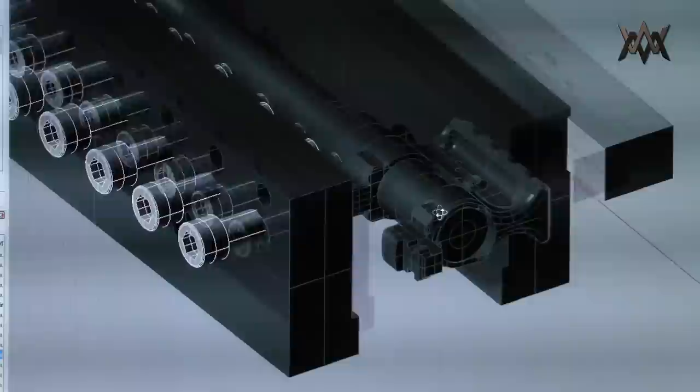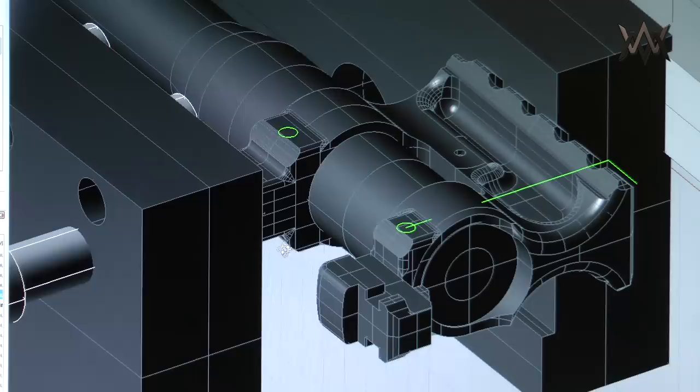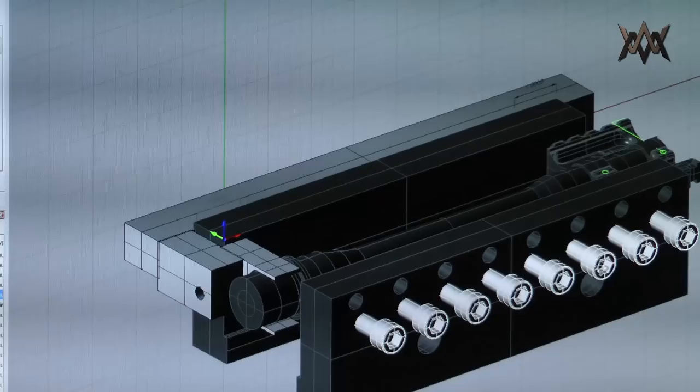It's not totally necessary, I don't guess, because the barrel is a 0.750 reamed hole, so it's a pretty snug fit when you try to slide this onto a barrel. But still, you'd like to make sure that it's as snug as possible when you're drilling these holes. And then you can come in and drill your holes here and here, and then run your taper reamer down. And that's how we'll pin in the barrels. So let's get to it.